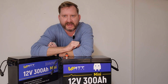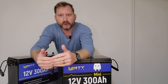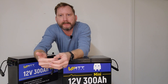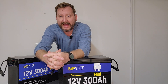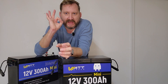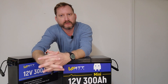I've talked about this repeatedly over the last year, and I'll reiterate — this is why I'm such a fan of 24 volt systems. By taking two batteries and putting them in series for 24 volts, your amperage gets cut in half. You get to utilize the BMS for essentially double the power while keeping your wire size reasonable and practical. So if you're going to be consistently pulling more than 1000 watts on the AC side, you'll need something bigger than a 100 amp hour battery — maybe 200 or 300 amp hours — and you should strongly consider going to 24 volts. You'll save money on not having to buy huge fat wires, everything runs a little cooler, it's a little safer, and you can draw maximum power out of the system without overtaxing it.